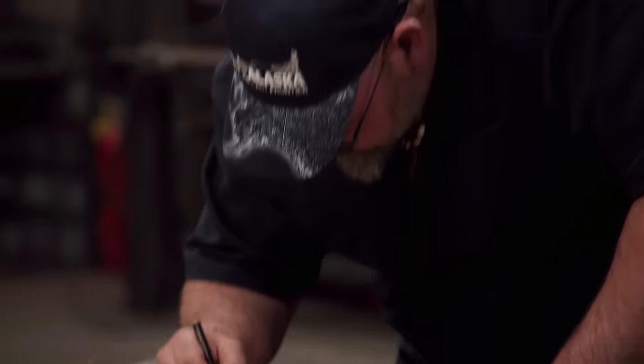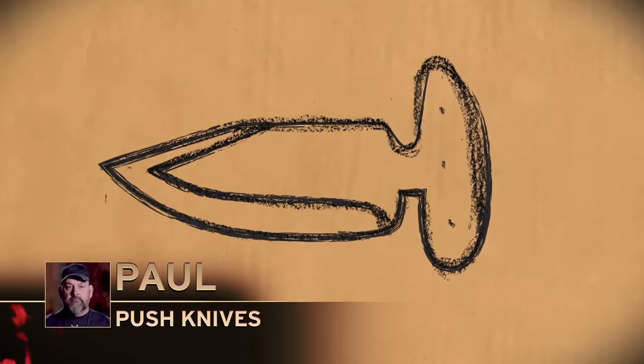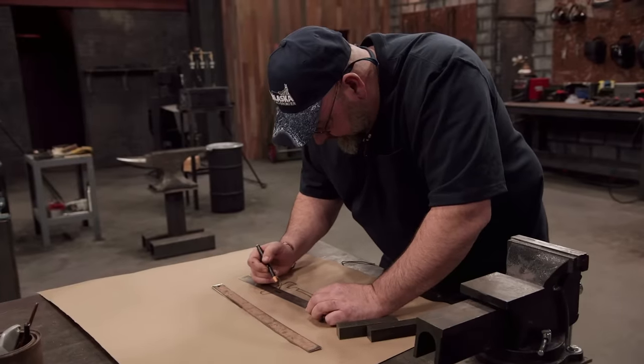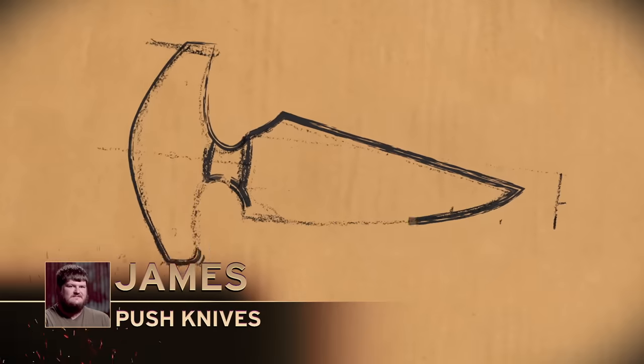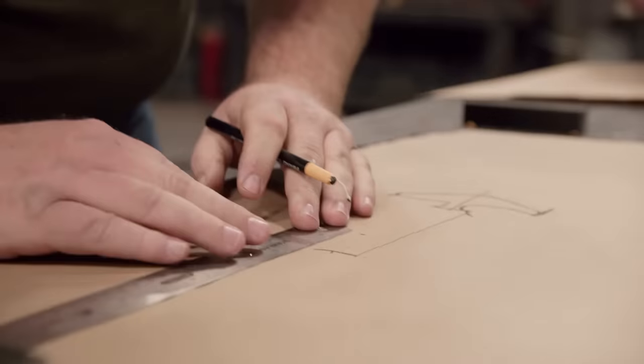I think I'm going to build a clip point dagger with a false edge on the top. There's a little more meat in the blade, and so it's something that will perform well in the challenges. The motto I got from my grandfather was there's two ways for a bladesmith to go to hell, and that is to hammer cold steel and not charge enough for your work. For the blade, I'm going with a long, sloping drop point fighter design. The toughest part of this is definitely going to be making a tang in a totally different fashion than I've ever had to do before.